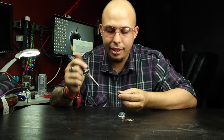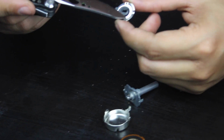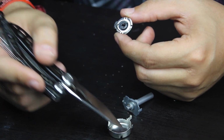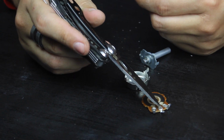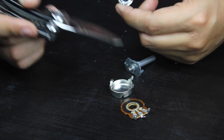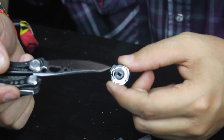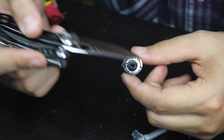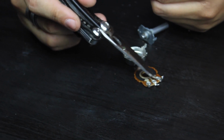And the next piece is all kinds of fun. This little spring section right here that comes up off center is the contact that actually rides on that inner circle. So that is our first point of contact from this pin. Physically goes into the inner circle, which is all conductive material for that pin. And this little piece right here is what continues that conductive or that contact. Now that goes through this piece of metal, which is one solid piece of metal. So the whole thing now, just from this point of contact, is now tied into contact with that.